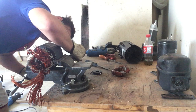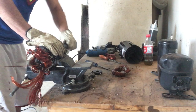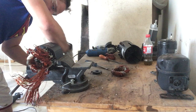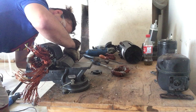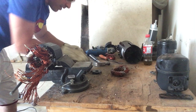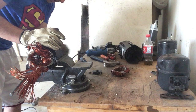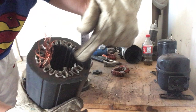This is your old-fashioned way, just using science, leverage, and eventually the pry bar. You can see the copper is feeding through right now. You want to make sure that all of your wires from this side are cut — sometimes if they are bent, it is hard to feed them through and they will get snagged. So you want to make sure you have it straight. If I turn this over, you can see some loose pieces here that could pose a problem, but I've already punched all the way through.